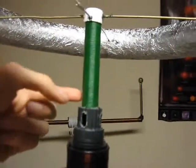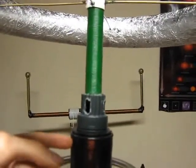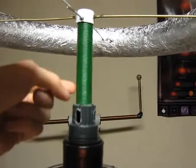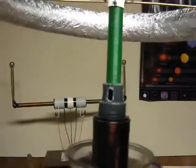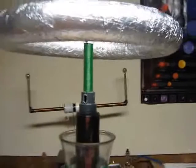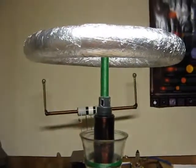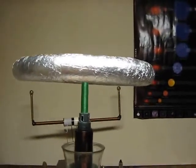I got this from Tesla's patent — much larger winding wire than this. Like I can say too, you can experiment with this as well. I just used 21 gauge magnet wire, and this is 30 gauge magnet wire. You can experiment with that — maybe bigger is better, I don't know. The system works, as you can see in the other video. I would also recommend maybe trying it on a different coil assembly. This is a vacuum tube Tesla coil, so there are little tubes in there. You can try it on a more traditional Tesla coil or maybe a more digital Tesla coil.